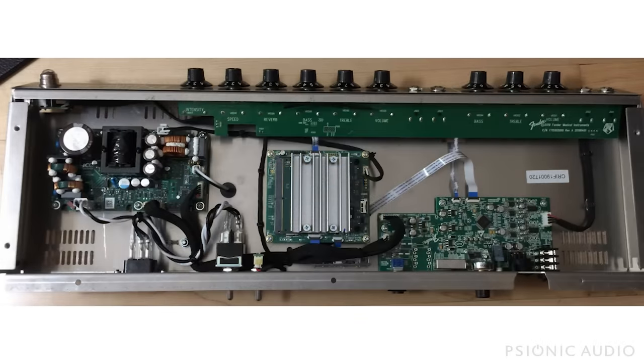One of the issues with this amp is that it is an odd digital amp in that it is self-limiting - intentionally, it does not play well with others. It has two IR outs, or you can turn them off, and the IRs are a choice of just those two. You can't say I want to try a Celestion V30 or an old Oxford - maybe future firmwares will do that. It does not have an effects loop, which to me is a very strange choice for an amp that does all these things. I understand they wanted it to be self-contained, but what if you wanted to put delays, reverbs, or other time-based effects in the effects loop? You can't - you've got to run it in front of the amp, which is not great if you've got the preamp dialed up for higher gain stuff.